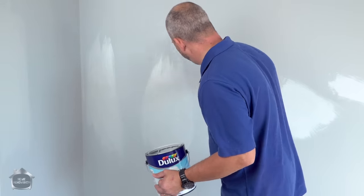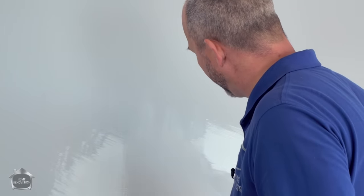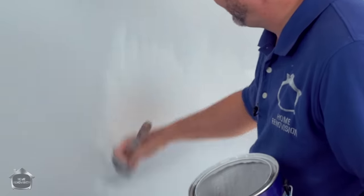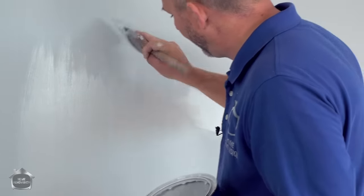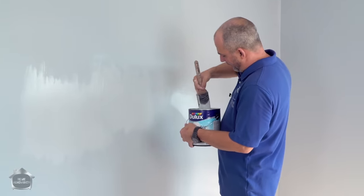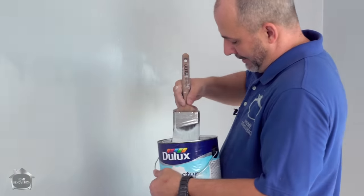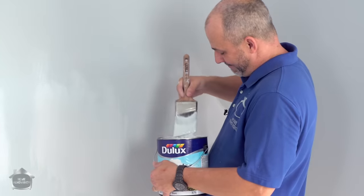Feather the edges. I'm using the brush repeatedly because it's a great fail-safe technique. If you have blues and reds you might find it necessary to do a brush coat and then come back with a mini roller and an extra coat on your patch, just to get the right depth of color. There are a lot of popular colors nowadays that are somewhat translucent — they're a real pain for repair work. You'll notice the time it takes to run around and hit all your patches — this paint will dry because we're putting it on real thin. The whole application only needs about five or ten minutes, and by the time you're done prepping your patches you can come right back with the brush or roller and put the final coat on.